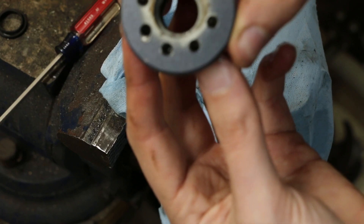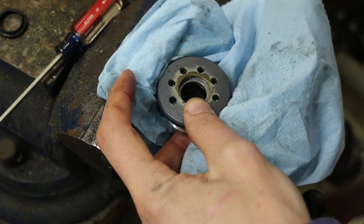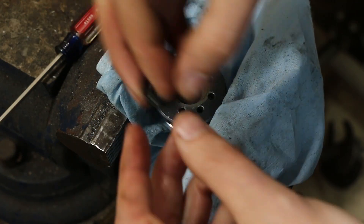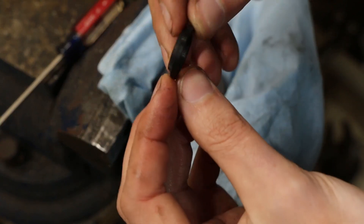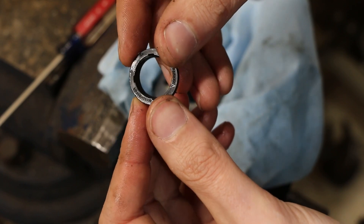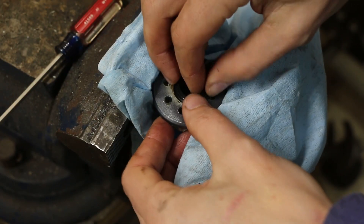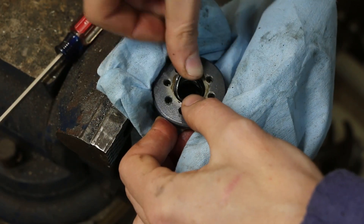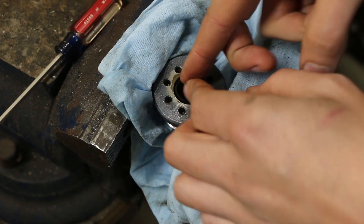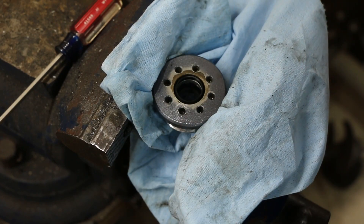If at all possible, I like to push on the outside edge because the inside edge is what seals to the cylinder, so that's going to have a tendency to wear more. Once it's in there most of the way, you can take your finger and twist it the rest of the way into place. Or if it's a little stiff, you may just need to use a screwdriver, and then that one is popped in where it's supposed to go. Flip this over and put in our dust seal — the taper side goes out to keep dust from getting into the cylinder. Work it down and get it into the spot. Once it's in that groove, this is ready to go back on the boat.